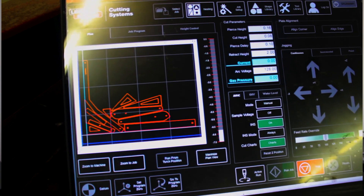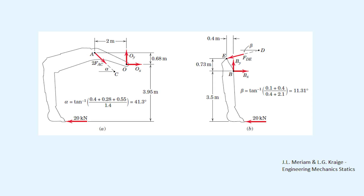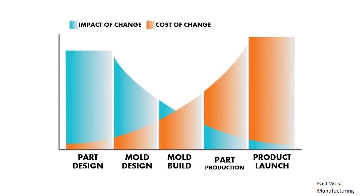I gave myself some room just in case modifications needed to be made. I won't bore you with the linkage theory as far as trigonometry, because there's a lot that goes into it. I will however talk about the design method chosen. This design method is called Design for Manufacture. Every company and almost every engineer uses this method to keep manufacturability of parts in mind — you have to understand how your parts are going to be made throughout the entire process, so you're not in the middle of your design realizing you can't make something.